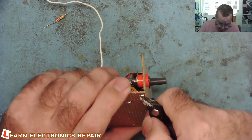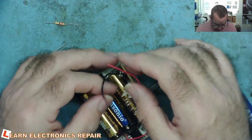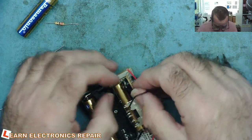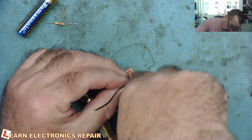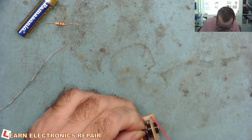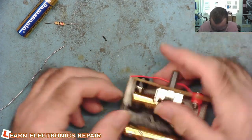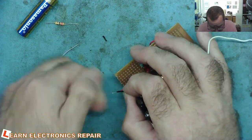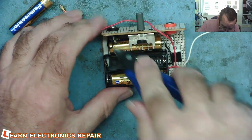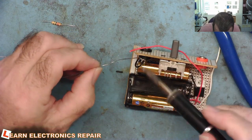The negative is done, and now the positive wire goes to the probe and to the switching contact on the switch. This one comes from pin 1 of our LM317. Then we attach our three resistors — connecting all of them together at one end, and the other end goes to the white wire which goes back to pin 2. So the first resistor: 22 ohm, soldered on with a bit of flux. We'll have the order 1mA, 8mA, 50mA on the switch.